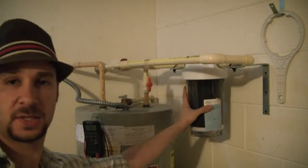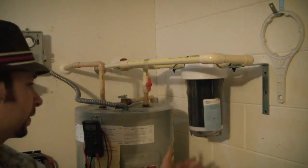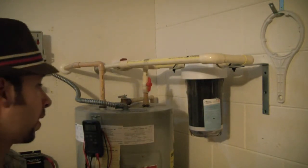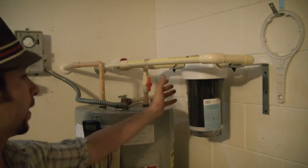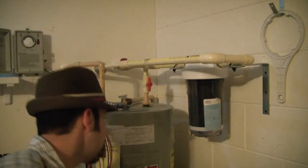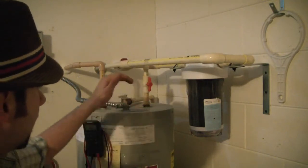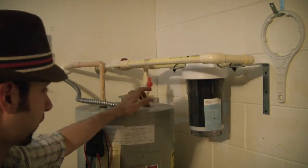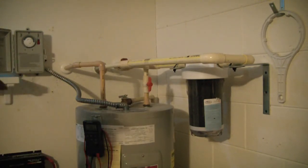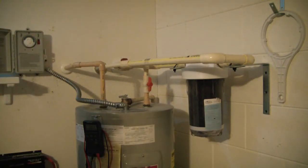I'm sure I'm going to get questions about this unit here — what is this? It's a whole house water filter. This is just to get the basic sediment and some of the nasties out of the water before it goes into the house. On my shower I also have a filter. Under my sink I have reverse osmosis — I showed you guys that in another video. This just makes sure you get the basic garbage out of the water before it enters the house. It's great to have that before the hot water heater, just to make sure you get calcium out of the lines. That way you don't have calcium deposits inside your hot water heater, and that leads to longer life of all your pipes and appliances.